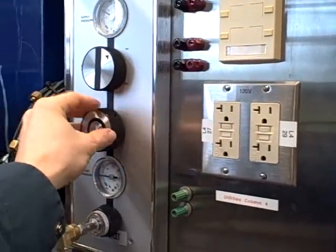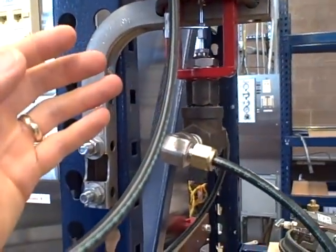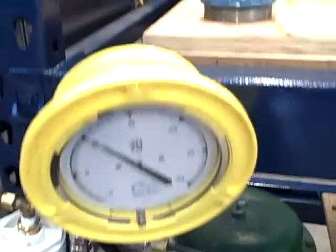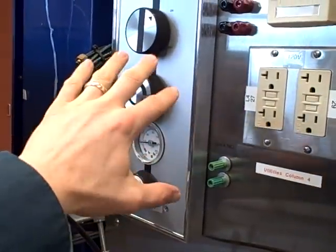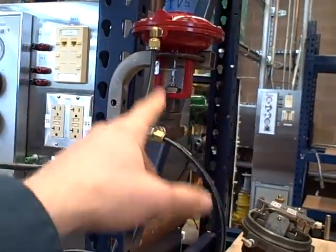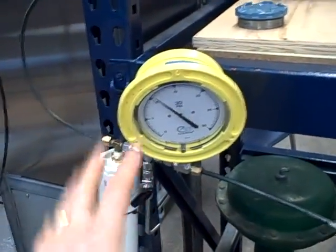Here we go. I will reduce my air supply pressure, which through feedforward action we're going to see this valve open up to automatically admit more air. Right now we're pretty close to 10 psi, holding where our set point used to be. I will now reduce our supply pressure — we'll see the valve begin to open up. The pressure still holds pretty steady at 10 psi. I actually dropped my supply pressure by about 10 psi, a change from 50 down to 40, and we saw just a fraction of 1 psi change in the vessel itself due to the feedforward action. Feedforward preemptively opened up the control valve to make it easier for air to go through, so that with less pressure we got the same flow rate coming in, helping stabilize and maintain pressure without any feedback action.